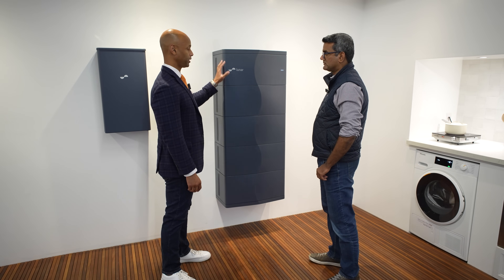In terms of PV input, you can connect anywhere from 12 to even up to 15 kilowatts of PV DC. For east-west facing panels you can go up to 15 kilowatts; for a typical south or southwest facing plane you can go up to a 120% DC ratio, reaching up to 12 kilowatts. There are three strings of PV, with a max string length of 20, and they all feed very seamlessly into the inverter wire junction box.